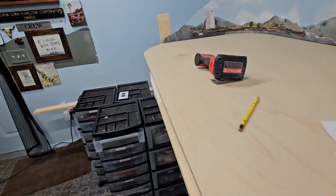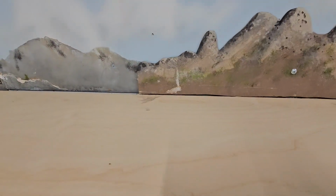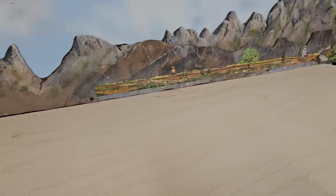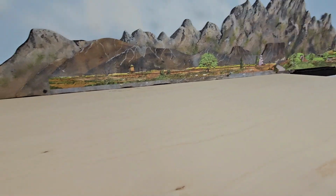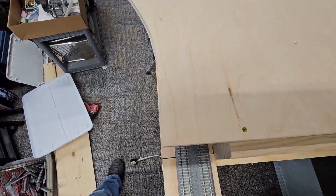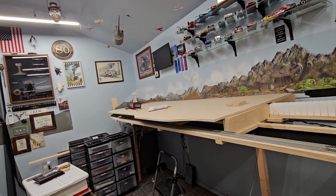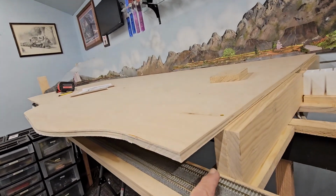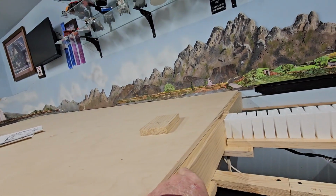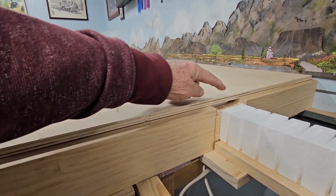And I have 2 reference screws in. One right there, and one right there. And what that allows me to do is now this board is exactly where it goes. And to get that board exactly where it goes, I had to take my vibrating saw and cut off the bottom of that masonite back there in some places to be able to push the wood back far enough to get these 2 pieces here parallel. So that is exactly where the board there will go, where the plywood will go. I doubled up the 1-bys here, so the next piece of plywood will screw on there.